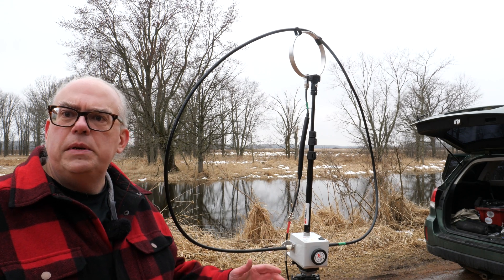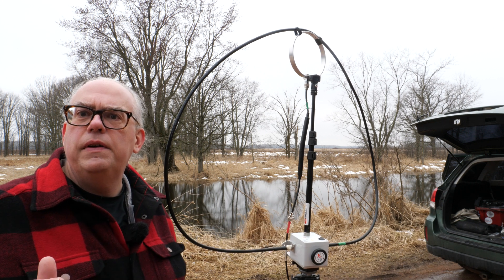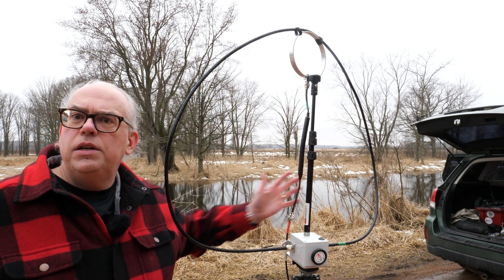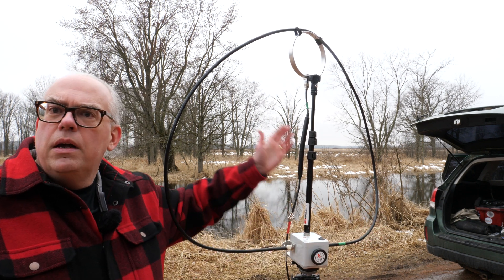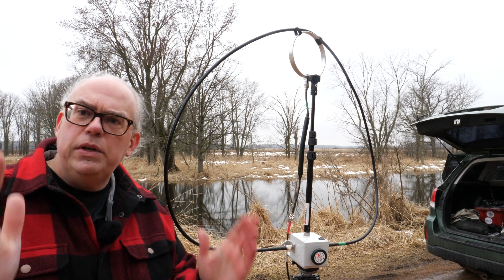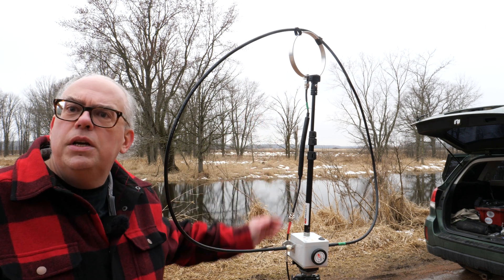So what's the deal with magnetic loop antennas? Basically, instead of a traditional antenna that uses the electrical component of RF energy, the magnetic loop utilizes the H-field — the magnetic field of RF energy. There are a couple of advantages to that. One is that you can have a relatively compact antenna, so instead of long chunks of resonant wire, you can have a small compact resonant antenna with a tiny footprint. Another advantage is that we can reduce man-made interference, so if we're in high-noise environments like an urban area, the magnetic loop antenna will help reduce that noise.